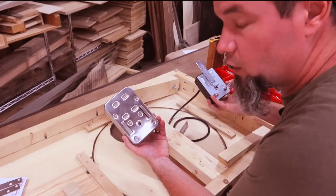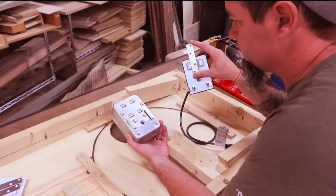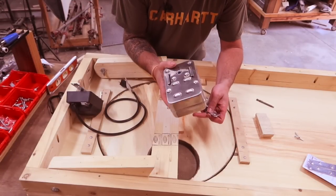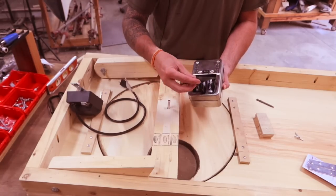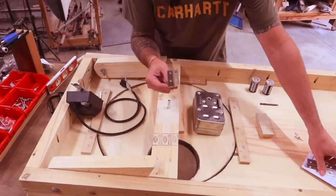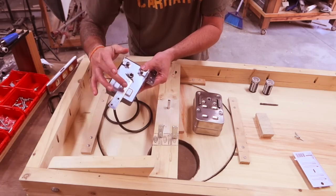We're going to have to make this mounting bracket a little bit bigger and mount it in a slightly different way. We're still going to use our four-inch flat stock, and we're going to up our side brackets to two-inch. The only extra things we're going to need for this mount are the new motor — which runs off D batteries — and two of the two-inch 90-degree brackets, whereas before we had the one-inch.